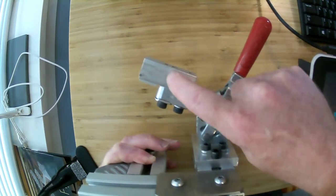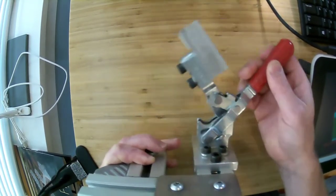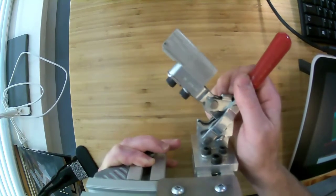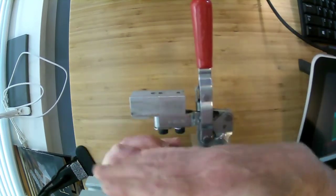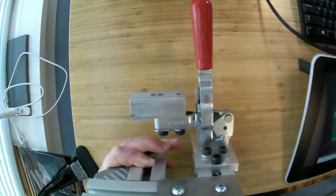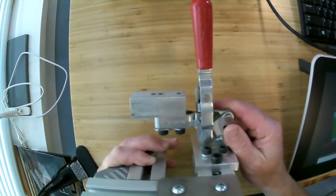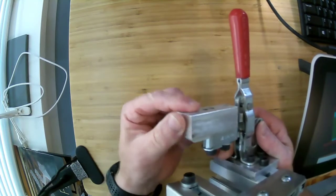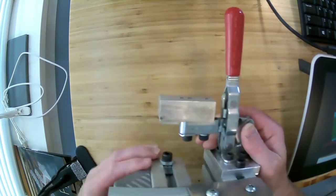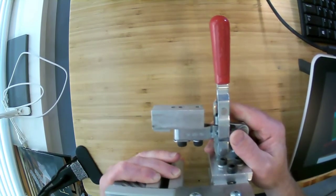Now it's a little weird that he puts this bar up on top of the clamp. Most people use these with the bar underneath the clamp, but he's actually done analysis of the motion of the clamp, and if you put things underneath, then they actually draw back in just a little bit. And if you put them on top, just because of the relative angles of all these places, when it comes into position, it is pushing down and still pushing inward some. And so he can get the right kind of motion that he needs that way. Notice that he's done some extra work on this. He's put this nice radiused edge here on the part so that as it comes in and hits the part that he's trying to make, it's not going to scratch it up.